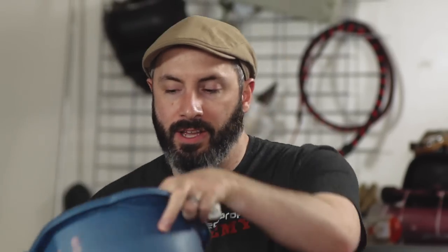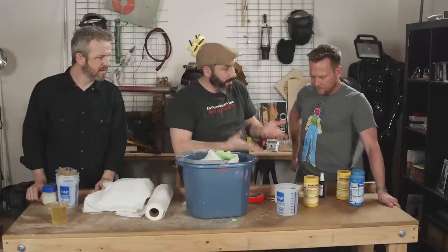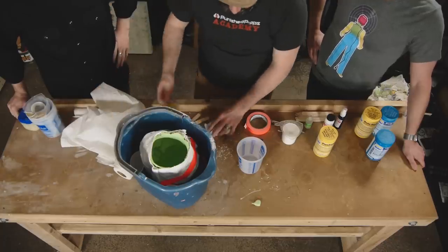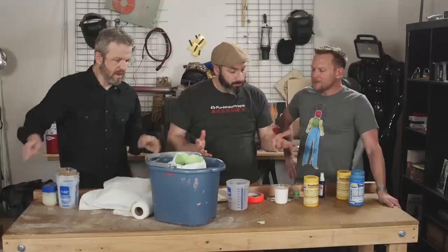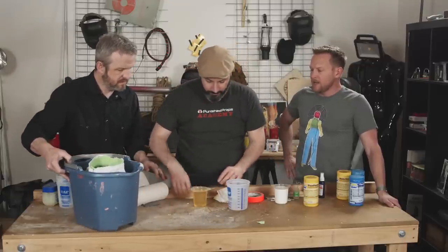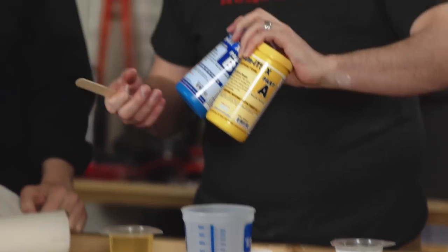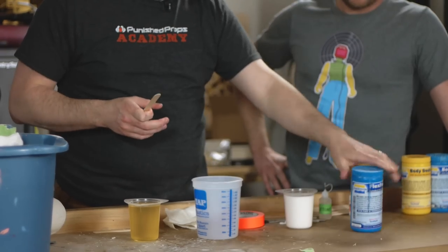I've already portioned these into a one-to-one ratio. There was a disturbing moment when you casually mentioned a head is about four liters — your head is about a gallon. This is the expanding foam — a urethane polymer in two parts. It's a liquid, and when you mix it together there's a foaming agent that creates bubbles so it expands. Then it cures into a solid — in this case a flexible solid, so it's a squishy foam.